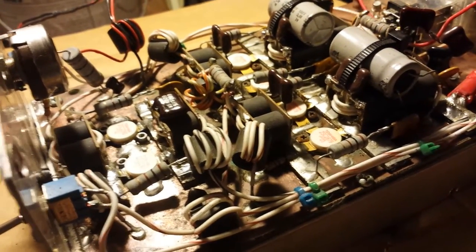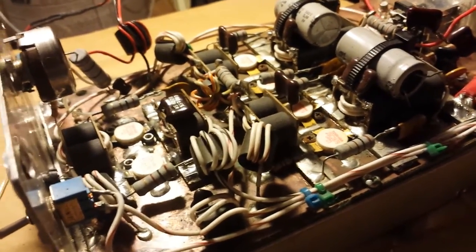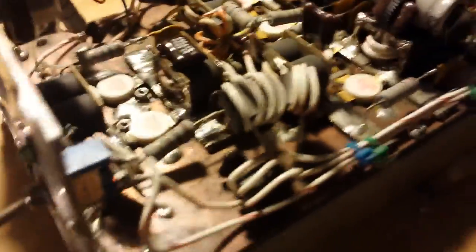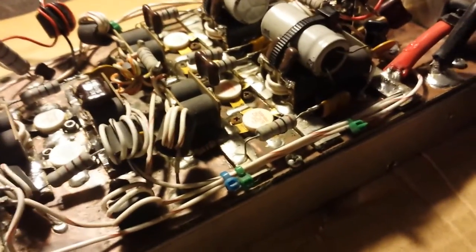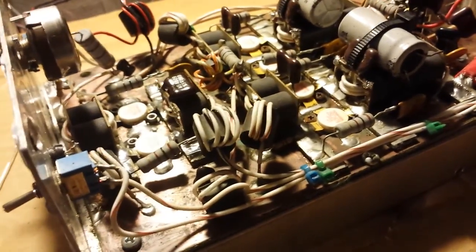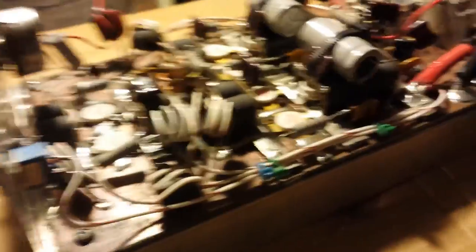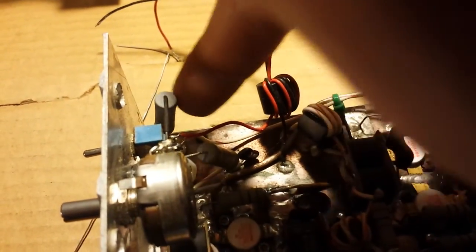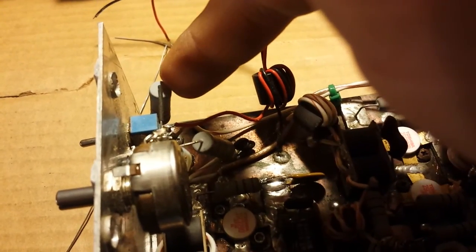Next thing was the actual size of the box — I didn't like that. It's kind of small for six transistors, if you ask me. It's smaller than my 1x4s that I do. 2x4s, 4 pills. So we went ahead and gave them a brand new Allen Bradley 100 ohm variable, utilized with a 5 watt 100 ohm. I always like to use the 5 watts going to ground there, just in case they wanted to turn that variable down so it can handle that heat.